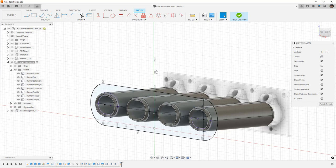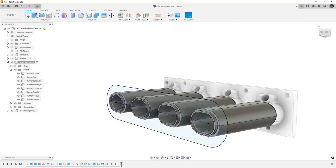Remember, you can build this to be welded together or bolted together. Bolting together has its own challenges — you need thick enough material so that it's rigid enough, so you don't need a million bolts to hold it together. That's just going to add weight and cost for raw material. Now that we have the sketch, let's finish the sketch and extrude it.